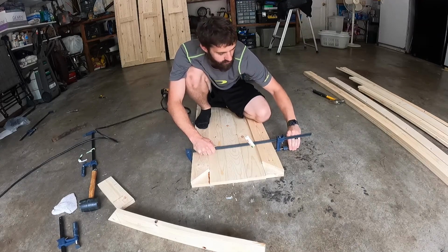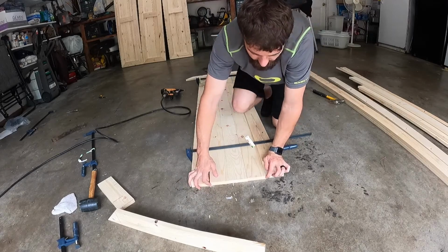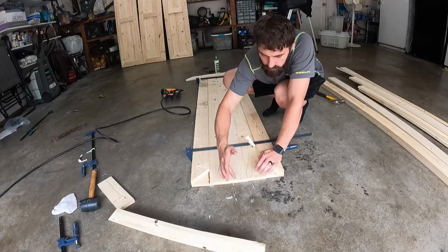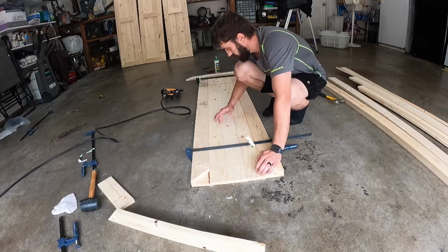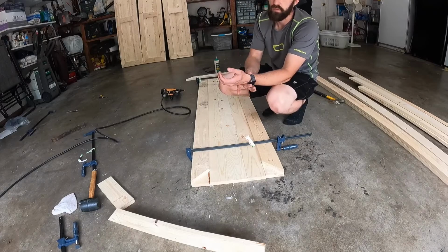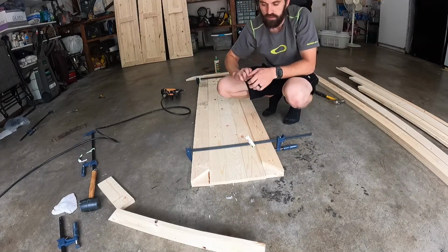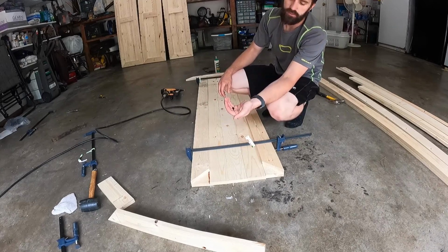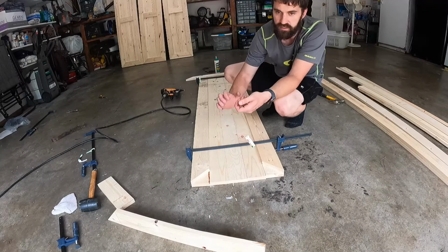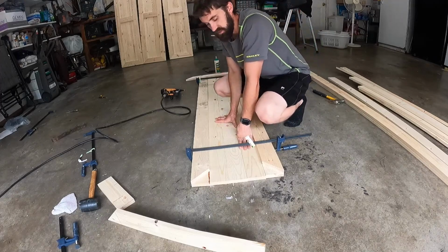But you gotta have the equipment to do it as well. And I got them coming in. Should be here today. Called French cleats. And I've made them before using a dado blade out of wood. But I just went ahead and bought 6-inch French cleats. When you make them out of wood, you use that dado blade and cut about halfway on one, halfway on the other, and then they'll fit together and make one. But on these metal ones, literally one makes a cup the other way. I'll drill one into the wall and put one on the back of these, and then I'll just be able to slip them right down on it. I don't think they'll slide this way. I think they're heavy enough they won't do that to me, but that's my only worry on those.